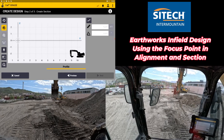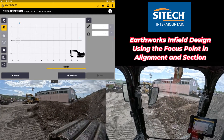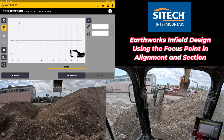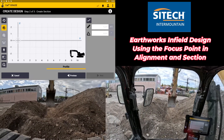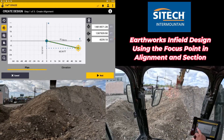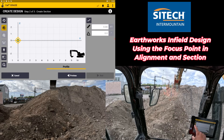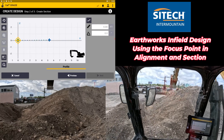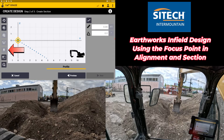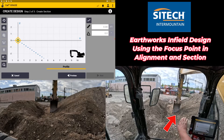If I go to Focus, you'll see the same screen that would come up if you did it manually. Over here, we've got a makeshift V-ditch that they want to use to match this road or the side of this pile. Right out in front of me I've got a slope off the pile down to a flat point and then back up. I want to mirror image this. I'll set up at the top, put my focus point on the middle, go to the next screen, start at the very top, and create a point. It won't let you change the focus point after you do it the first time, so that's why I picked the middle of the bucket.